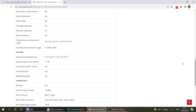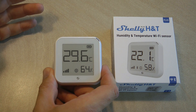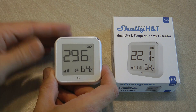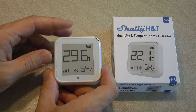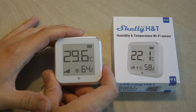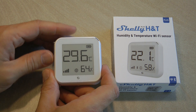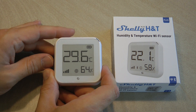Being a Shelly device, this also works by integrating devices using simple URL calls. This Shelly can call a URL, and if that URL happens to be one of your Shelly relays, it can turn that relay on and off. I really like this feature because for a simple automation you can have Shelly devices talking directly to each other without any servers, cloud connection, or subscription.